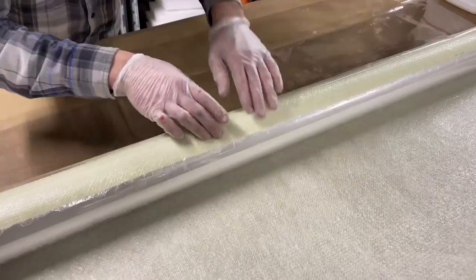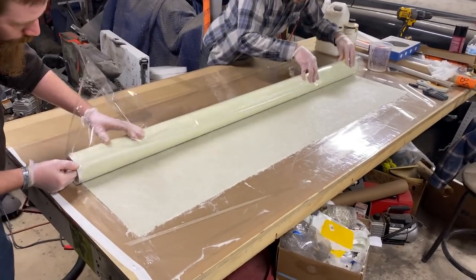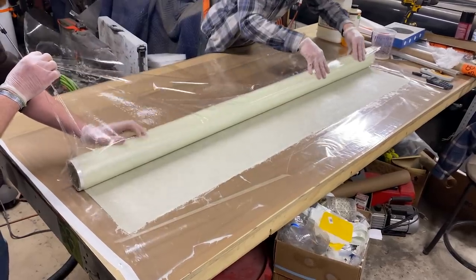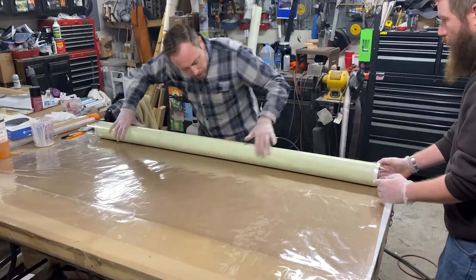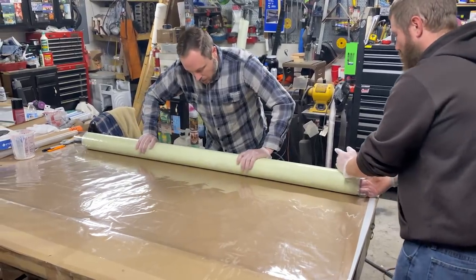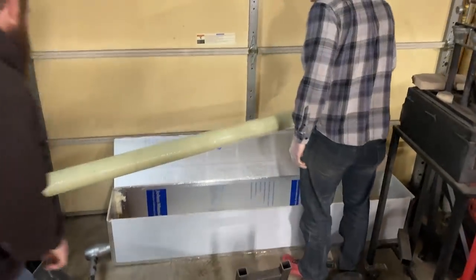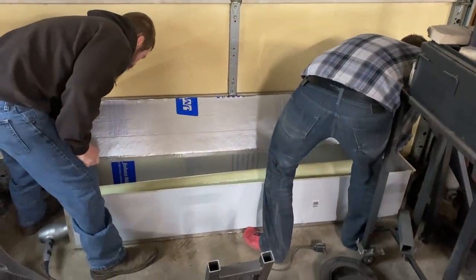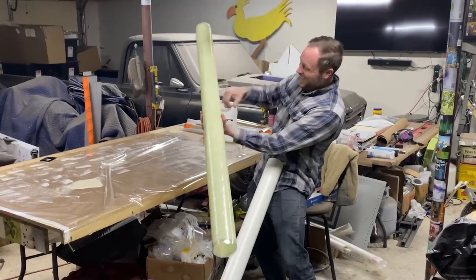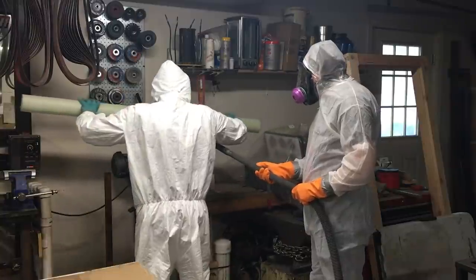I got a three-inch PVC pipe with an outside diameter of three and a half inches — a perfect size for my scale. I wrapped the PVC pipe in cellophane gift wrap as a release agent before doing the composite. I had a roll of high-strength fiberglass I got on clearance that was big enough to wrap both tubes. I did two wraps of fiberglass around the cellophane-coated PVC, put it in a foam box with a hairdryer stuffed in one end to provide heat, and after it cooled the PVC fell right out.